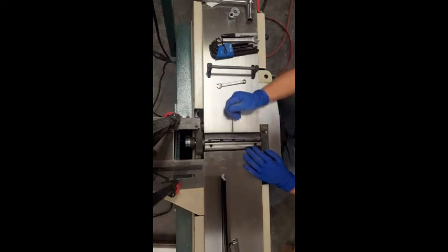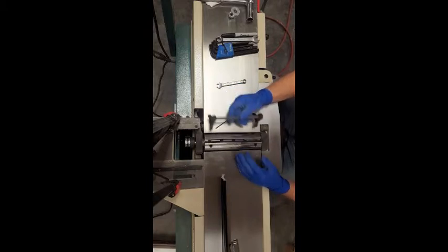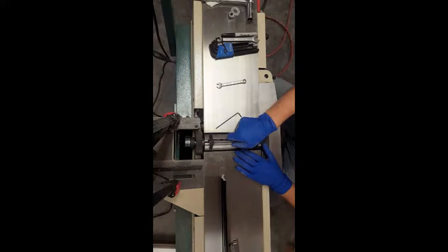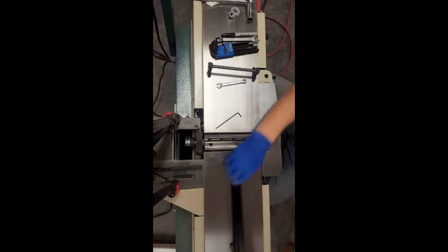As you go to adjust, you're going to put your new blade back in. Follow the rules in the manual — if you've got the manual, it's on page 40. Basically, you set the jig right on top of the drum, and the blade should just barely be touching this part while these two sides sit flat or flush on the drum. You should be able to set it right on top of the blade and you shouldn't really have any wiggle in there at all. You can use that method, or you can use a straight edge with some feeler gauges.